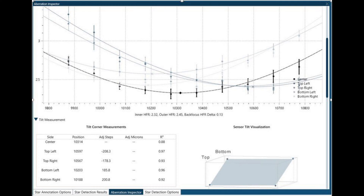The other option — if you use Nina as your image acquisition software — there's a plugin called HocusFocus which has a great tool built in: an aberration inspector which gives you a 3D graphical representation of your sensor and whether you've got any tilt, and which corners of the sensor are actually tilted. It is quite complex and gives you a lot of numbers that can get confusing, and again you'd have to do your adjustments outside on a cold night.